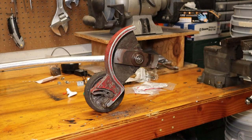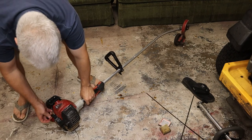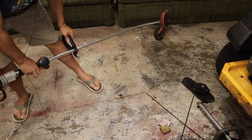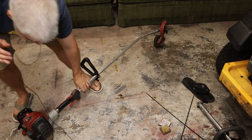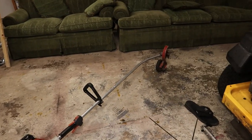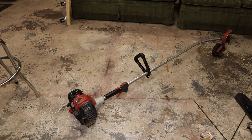Let's stay focused on the original repair - let's see if it runs and the blade turns. Here goes nothing. You guys can see that the blade is turning. So all fixed - at least the flex shaft is. Hopefully you guys found this video helpful. If you've got a Shindaiwa or Echo edger, or even a weed whacker, and the engine races but nothing at the business end turns, check your flex cable. If you found this video helpful please subscribe, stay safe, and thanks for watching. Maybe when it comes back for the blade - when that wears out - maybe we'll do another video on the cutter head replacement.